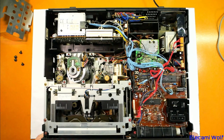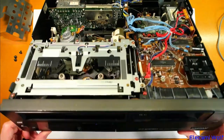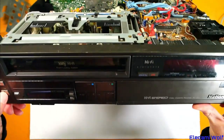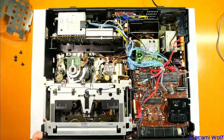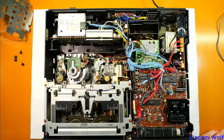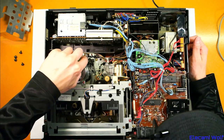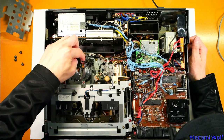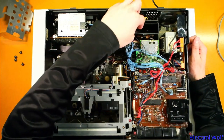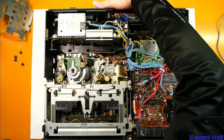No joy. Still switched it on — a light there is on, an LED. But there's no sign of clock flashing, and the power button is dimly lit. So this suggests it's not in very good shape. We'll need to work out voltages and things to check. Remember last time we found there was cracking on the solder joints like in the other machine — cracking on solder joins where that regulator is, and also on these heat sink parts where the other regulators are. Perhaps we'll take a look at that first.